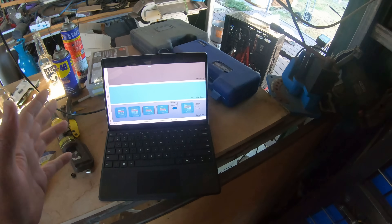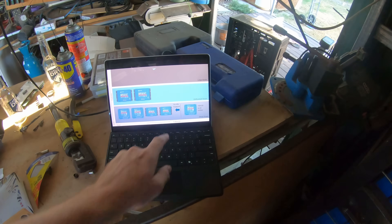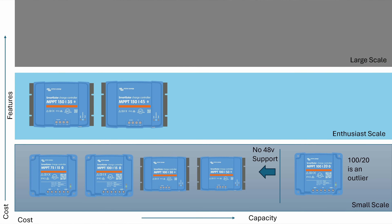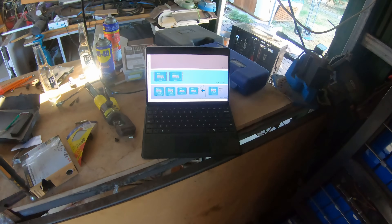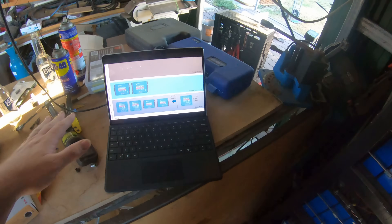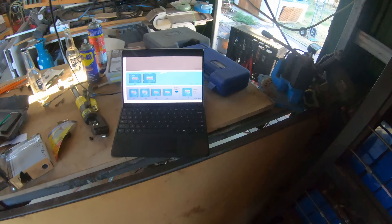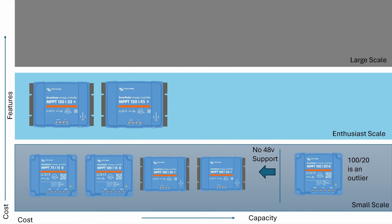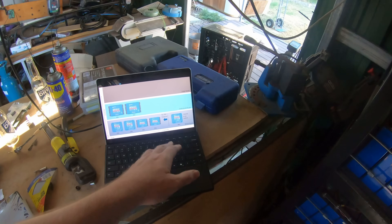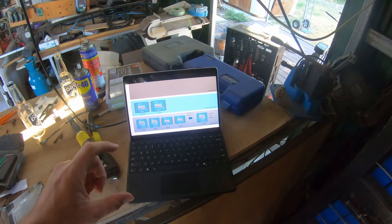So this is where the 100/20 is an outlier. It doesn't actually have the same output — it just supports 48 volts, but doesn't actually have more capacity than the 100/50, for example. But then we jump onto the 150/35 and the 150/45, and in my opinion they're in the enthusiast scale. The enthusiast scale is greater than 2 kilowatts, with the exception of the 100/20 which is straddling the two at 1,160 watts.